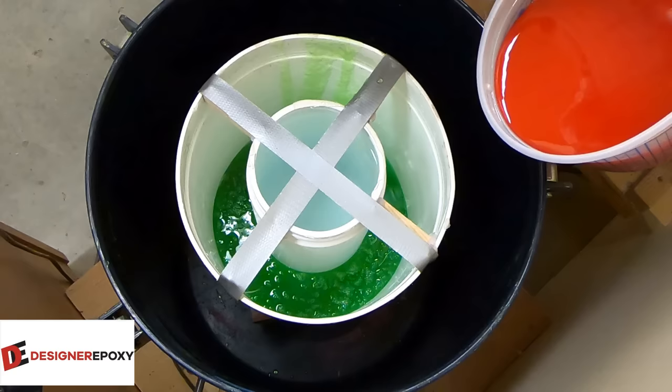So the goal now is to level out any of the epoxy that didn't lay out flat. So that's what I'm doing here. I just started sanding at 220. On the outside, it was actually fairly easy. A little more difficult to do on the inside, but the great thing about using that top coat of epoxy was that it did fill in all of these little voids and holes that were inside and outside the piece. Otherwise, you would have had to deal with it in some other manner. So anyway, it was sanded from 220 to 800, and then of course it's going to be buffed like I usually do with the triple E buffing compound. And then once that's done, we'll clean it up with some denatured alcohol and get our second coat of finish on.